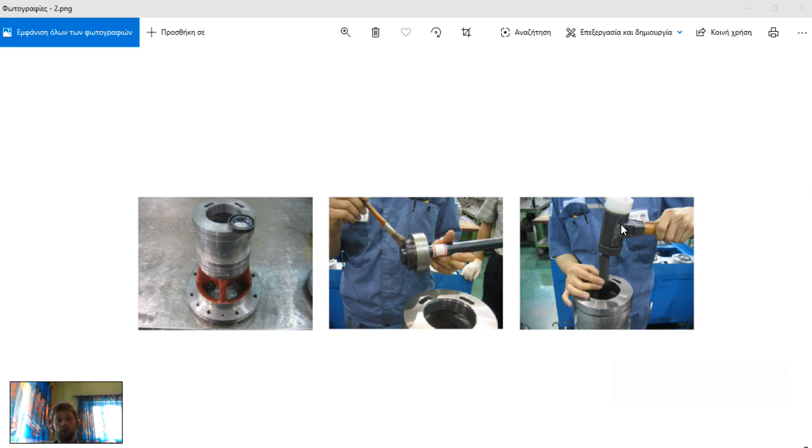With a soft hammer weighing about half a kilo, it is really easy to control and slowly insert our seal. The installation plays a big role for the life of the pump over time — if our installation is good we will have a prolonged life of our pump. A big role is also played by the temperatures and the media circulated through our pumps. For a low temperature pump the temperatures are not so high, so the life of our components will be extended. On the other hand, a high temperature pump looks almost the same but the temperature is higher, so the life will be reduced.